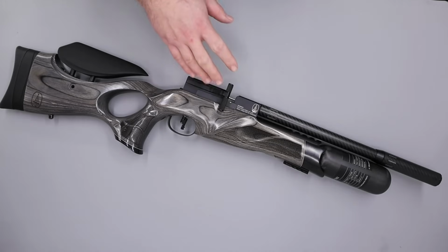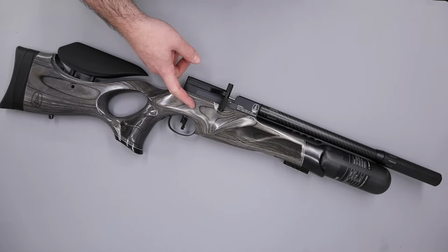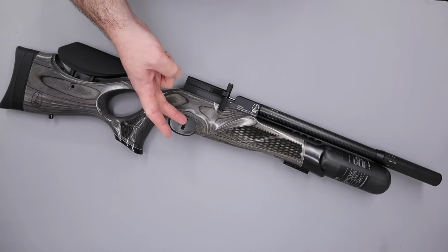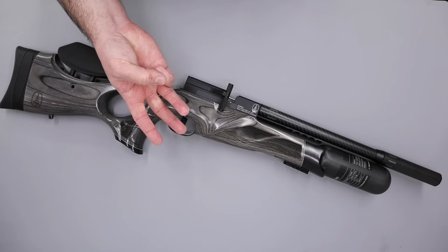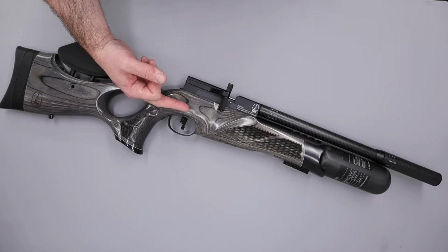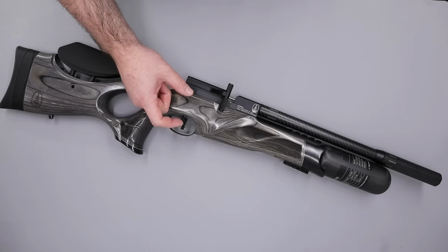And finally, some of the components in the block are designed a little strangely. The one that stands out to me is the design of the hammer. So you have the hammer weight and the striking face, the hammer shuttle, and then the cocking pin which runs through the centre of it. The cocking pin is a weird design as it requires a grub screw to go in through the back and secure the cocking pin in place.